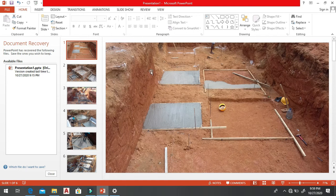You can see the footing size — we get the excavation from these edges. If the existing ground to the bottom of the footing height is 1200mm, you can just measure that distance from your steel tape and then cut this area. After completion of the excavation, if this is the blinding area, you can install the level machine and level it.